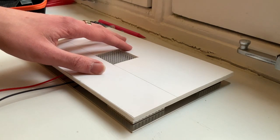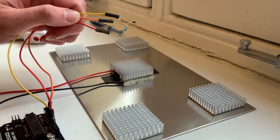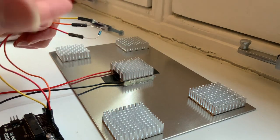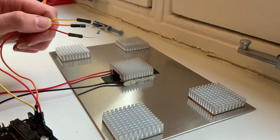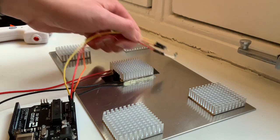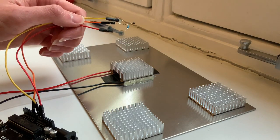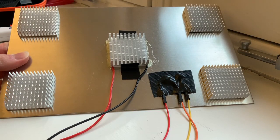A potential issue with using foam board here is it's quite insulating, so it may reduce the amount of heat that I can transfer away from the plate. Now I need to work out a good place to put the thermistor, because if I put it too close to the Peltier cooler it will be too cool and the whole system won't work. So I was thinking about putting it either here or here, but really what I need to do is look at my laptop and try and identify hot spots.